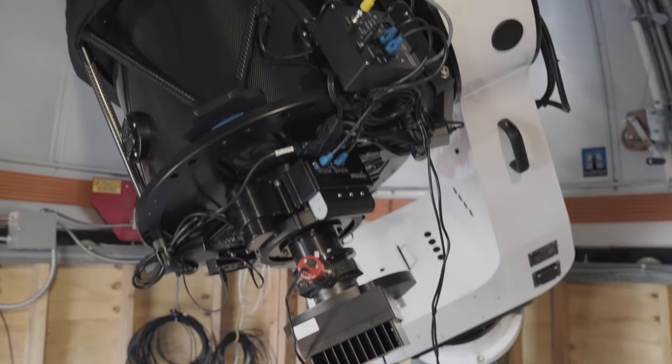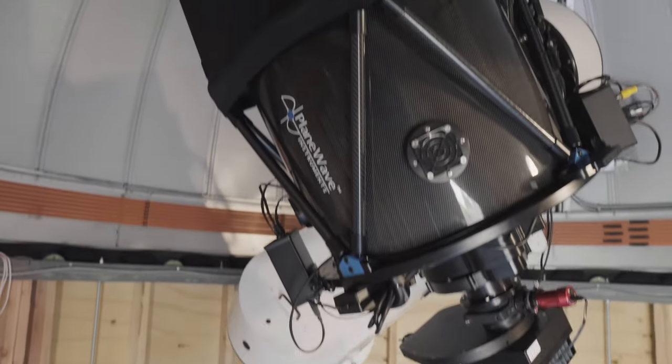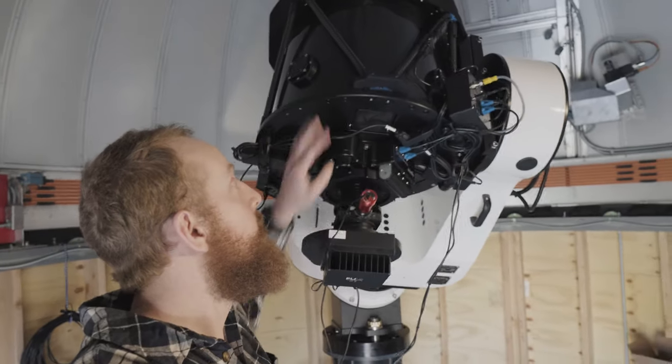We have the accessories on the telescope. We've cable-routed everything — it's zip tied, secured, and we checked the range of motion. We balanced the declination axis and then balanced the right ascension. When we actually move the telescope, whenever we point it, it's just going to stay stationary. When we say balancing a direct drive, that is what we mean at PlaneWave, because that's going to allow us to perform a high-quality tune on the motors and yield high-precision tracking around 0.05 to 0.15 arc seconds.